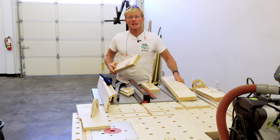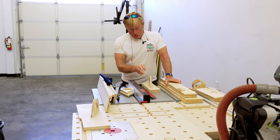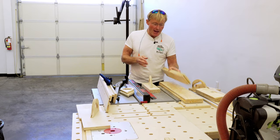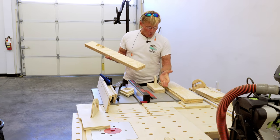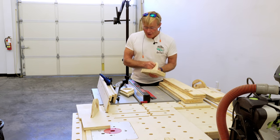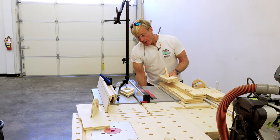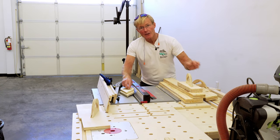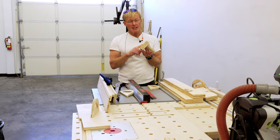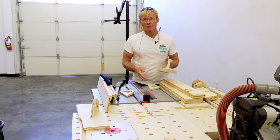I wasn't really careful about flushing the pieces up — you can see they overhang a bit. What I'm going to do first is run one side through the saw to get a nice clean edge, then decide on my width, flip it around, and run it through for the second pass. When I make my cuts on the table saw, I lift the blade up to the thickness of the material I'm cutting and just slightly more — not even a full tooth. So I'm not going to be cutting in too deep into these. And I don't have any metal in here, so there's no chance of damaging the table saw.